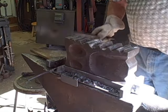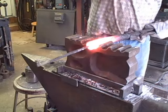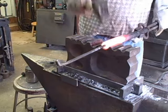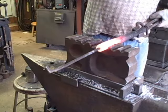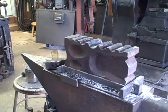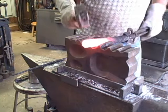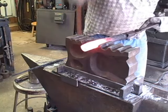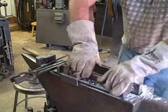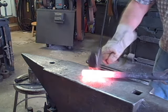It's unlikely that they would get a hole centered anyway. Once in a while I'd have a little more trouble getting the mandrel out, but most of the time it came out fairly easily. The next step that a gunsmith would do would be to make this round barrel into an octagon by forging and filing. All the other steps that I described earlier would go after that.